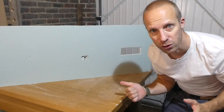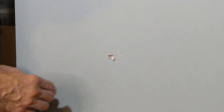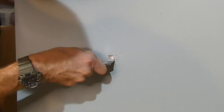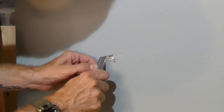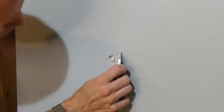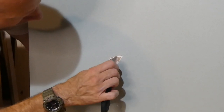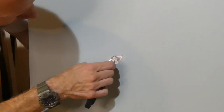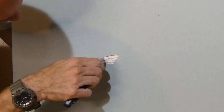They're all pretty common holes that you would find in plasterboard and what we need to do is sort them out to make them look like they were never there in the first place. Initially we'll clean this up ready for filling. I'm going to take a sharp knife and just cut a nice clean edge around where all this paper has been ripped. We don't want to start filling where it's all rough, so get rid of those rough bits of paper. I'll also just take a little bit of the plaster out along those edges so you've got somewhere for the filler to go — give the filler a little bit of depth. That is ready for filling.